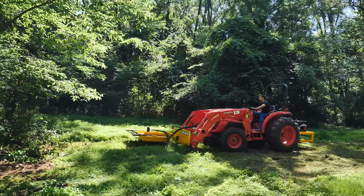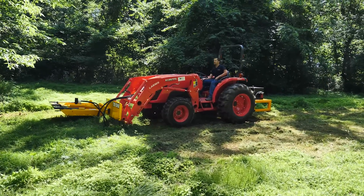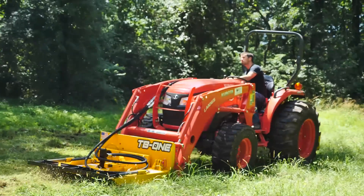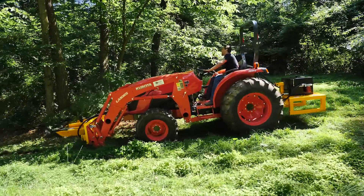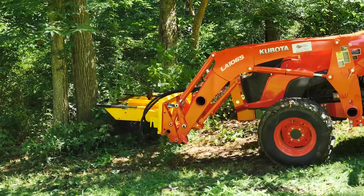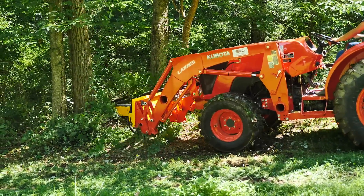One thing I did earlier that I did not care for — it doesn't do a great job of cutting really close to the ground. I came out here and tried to mow this grassy area before we filmed. Once I set the thing on the ground and wanted to drive forward, it digs in and doesn't contour or skip across the ground real well. Mowing in reverse seemed to fix that — it kind of defeats the purpose, but if you wanted to mow right down against the ground, you can set the thing down and back up with it. It drags back a lot better than it pushes forward. There's some junk in the bottom here that I wouldn't normally be able to drive over, but I can easily use the loader to lift the mower up and then set it down on top of the area I want to mow — so if you want to clean up around downed trees, it's an easy way to get in there.